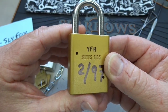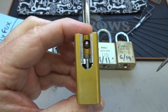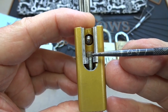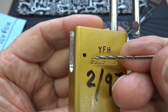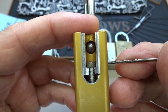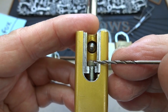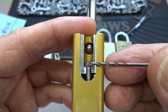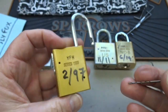We're back. I went ahead and milled away the side of the lock — you can see all of the internals, the ball bearing locking mechanism, and the screw that holds that bottom plate on. That's kind of what this hole is all about. If we want to defeat this lock using this very conveniently provided pilot hole, we take a drill larger than this — say a quarter-inch drill — and that hole is perfectly, and I mean perfectly, aligned with the center of that screw head. That screw is not hardened steel; it's fairly soft steel. So if we use this as a pilot hole and drill through here, we can knock off the head of that screw and all the guts will fall out — we've defeated it in about two minutes on this aluminum body lock.